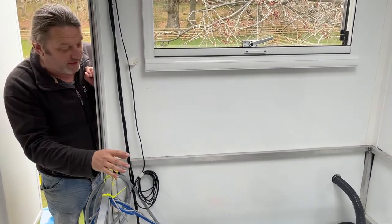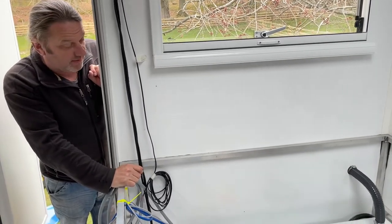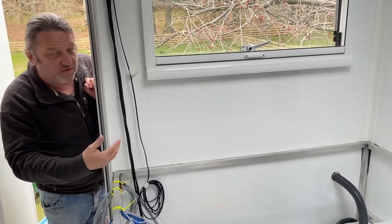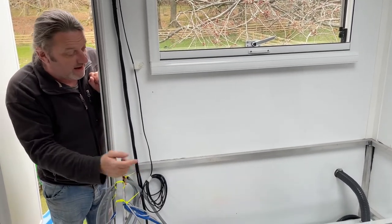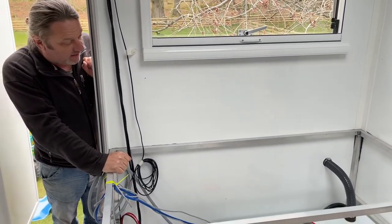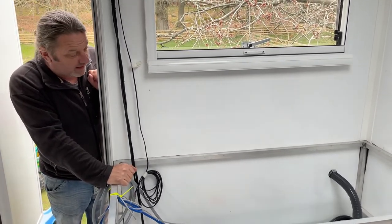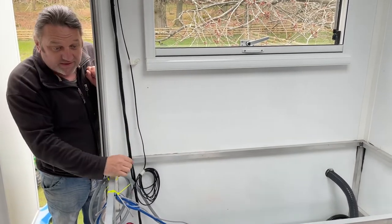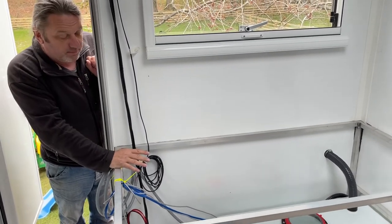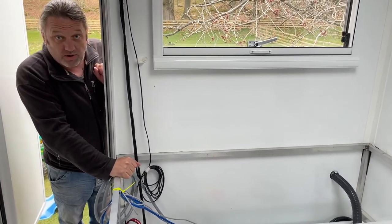And if everything's working away fine, we're going to add some Instaclore tablets to it, which is a chlorine tablet, making a solution. And we'll fill the tank, move the truck back and forward a few times, give it a good slosh out, give it a contact time of 1 hour, and then we're going to drain that back out again into a different tank, and we add thiosulfate to that to take away the chlorine, and then we'll just put that down the drain, it just turns it back into water again. And that's a tank this size, classed as super chlorinated, and it'll be potable water thereafter that when we fill it back up again once it's all cleaned out, it'll be good to go.